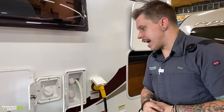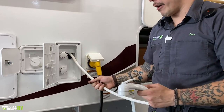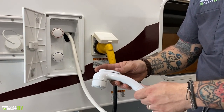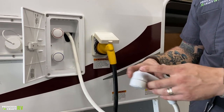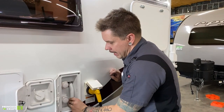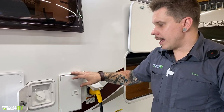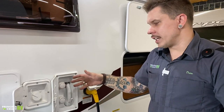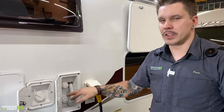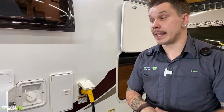Beside that, we have your outside shower with access to hot and cold water and a pull-out sprayer. The sprayer has a hard on/off switch on the fixture. What I've seen happen is that people forget they have these valves on — they feed the hose into the cabinetry and that on/off switch is oriented toward the door, so you can inadvertently turn it on. Just make sure you have these valves in the closed position to keep from making that mistake.